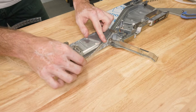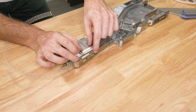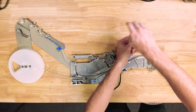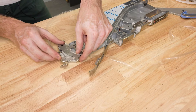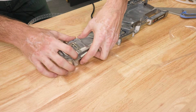Same as before, bring your first component to about the middle of this window and feed the film through the window. Make sure the tape exits cleanly down and pull it onto the sprocket. With these thicker tapes, the window is also wide enough to just push your finger through.